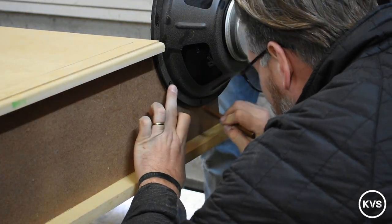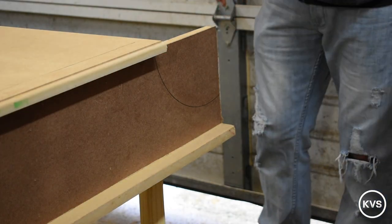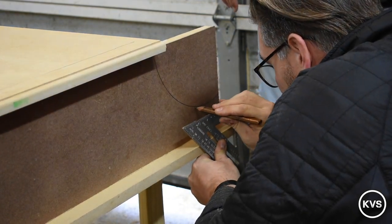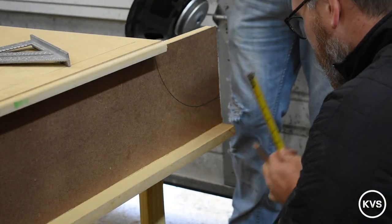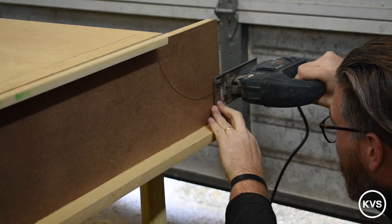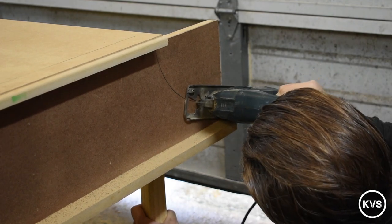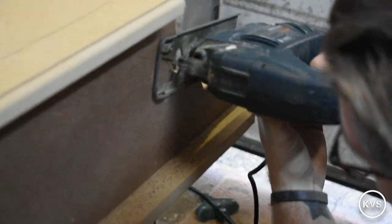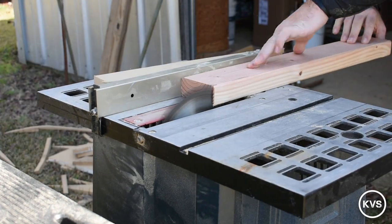This is how we decided to get the curve on our corner — a little decorative piece to give the piano a real piano look, just straightening out that corner. Here's one of the mistakes I made: I decided to cut this piece with a jigsaw, but the mistake was attaching the lid first. The plate of the jigsaw was not going to go any further, so I had to just take big bites out of it.